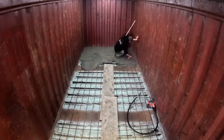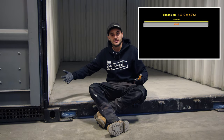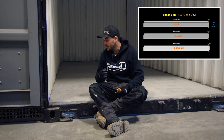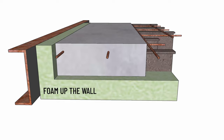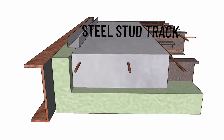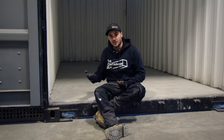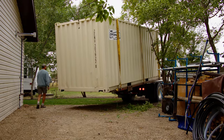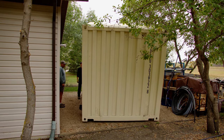Because this is actually inside a heated tempered shop, we're not that worried about the insulation or the thermal expansion of the concrete compared to the steel. But if this was something we were going to utilize as a portable office, we would most likely continue the foam up the sides so that we'd stop steel cross members expanding at different rates than the concrete slab itself and causing the concrete to crack. That's something we would do differently if this were a mobile portable solution.